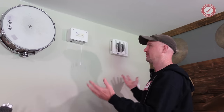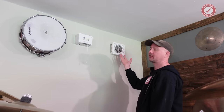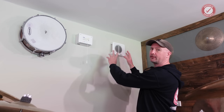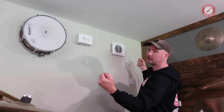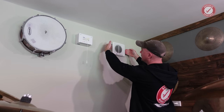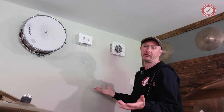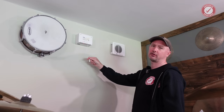In a nutshell, that's it — nothing more complicated than that. It just sits there trickling fresh air into the room over the heat exchanger, and takes humid stale air out through the side vents. If the humidity gets too high, it automatically puts itself on boost, and if you want to force boost you just pull the little cord.